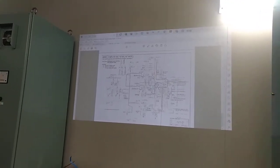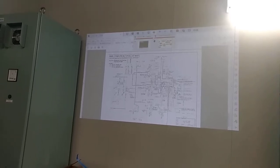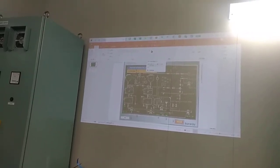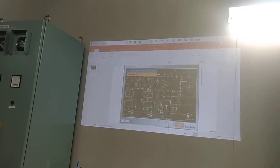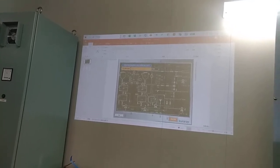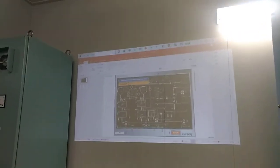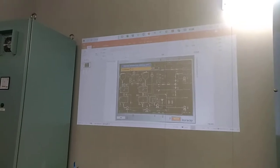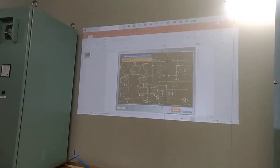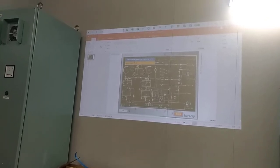Okay. For the complete hold, first before we go here, I'll explain first how the chemical is being prepared, because this is needed during your operation. So we have here, I don't know if it's clear, on the right side we have AS1 and PW1. On this side, AS1, this is for ballasting. So this is disinfectant. So manually you put the chemical here. And then at the middle, you have HT tank. That is for fresh water. So for the fresh water, we need only to open the valve here. There is a manual valve.